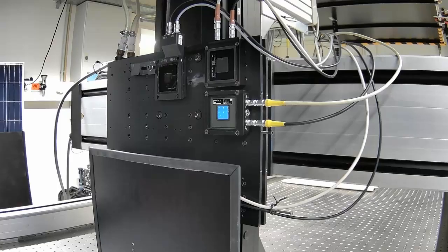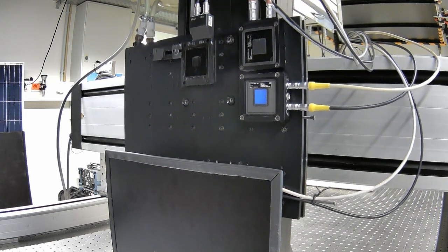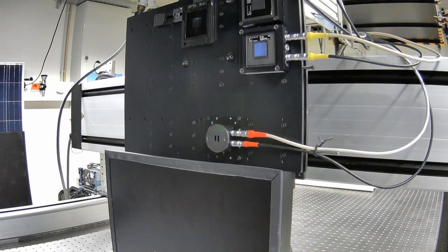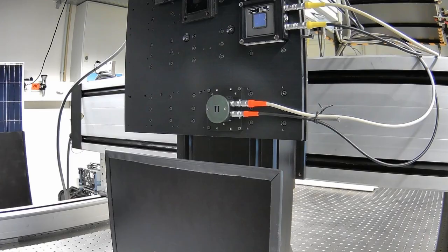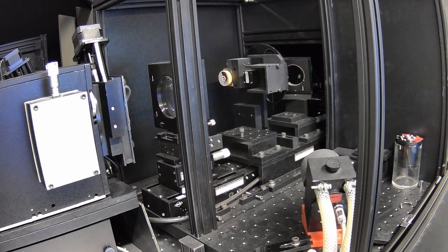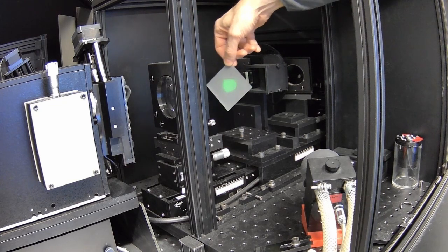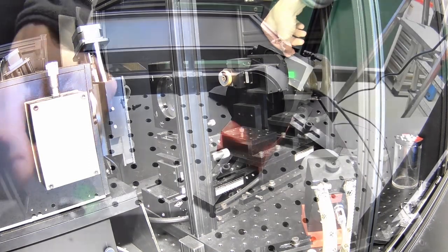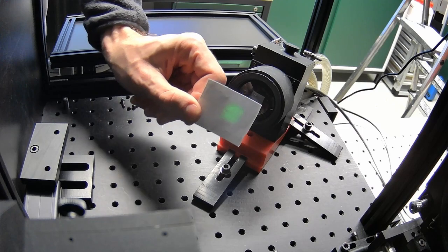Number 7: Monitor principle. In a DSR facility, the device under test and the reference device are usually measured subsequently. A drift of the monochromatic spectral irradiance between these two measurements would lead to a falsification of the measurement. Therefore, it is advised to apply the monitor principle. A fraction of the monochromatic light is coupled onto a monitor detector. The reading of the monitor output signal can be used to correct for any drift or fluctuations of the monochromatic irradiance.